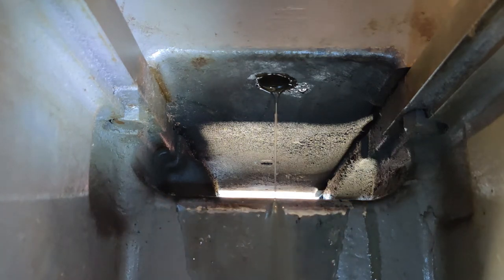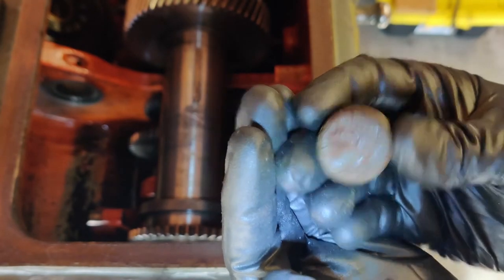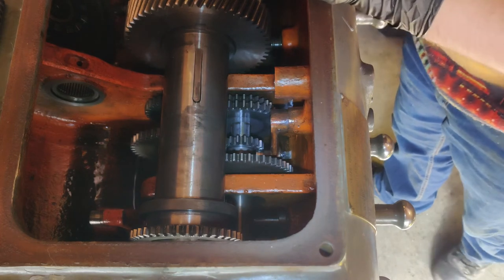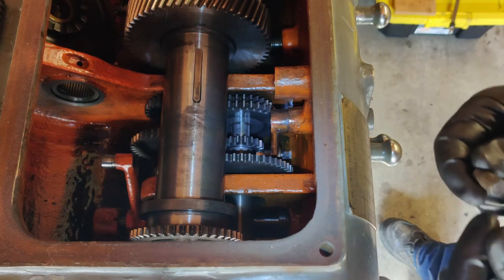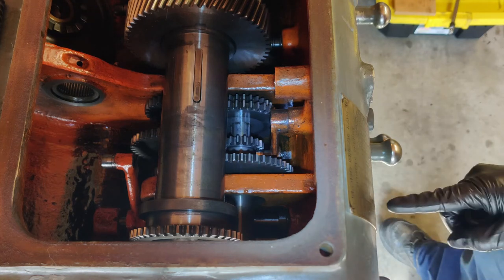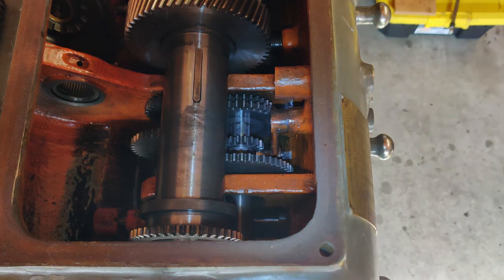Let's stop that here and get inside the headstock. It's just as well I'm getting in there because there might still be some bits of crud and rust in the bottom — this plug doesn't look too great. If I can get everything cleaned out of here, that'll fix that. Looking at this, there are a couple of collars holding this in place. I accidentally pushed this around a bit earlier and I'm fairly certain there was a ball bearing on one end indexing on the front plate — unfortunately that ball bearing is missing, but single ball bearings are pretty cheap.